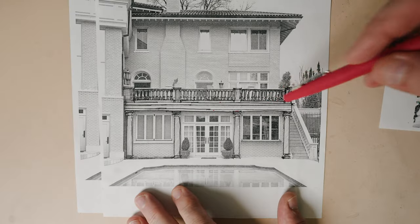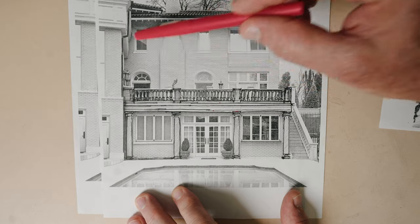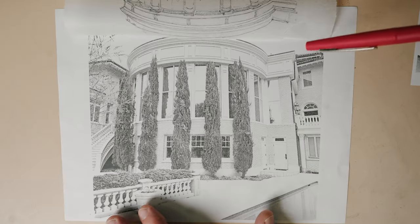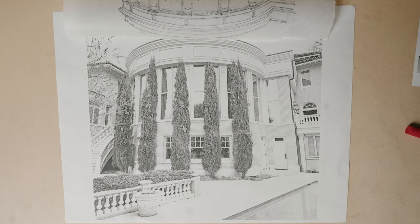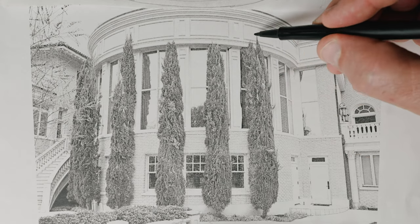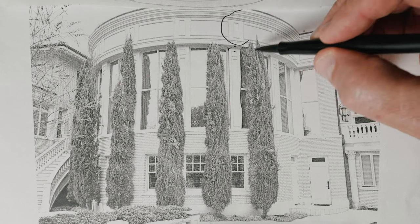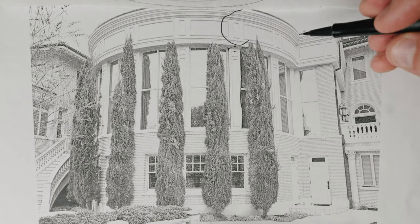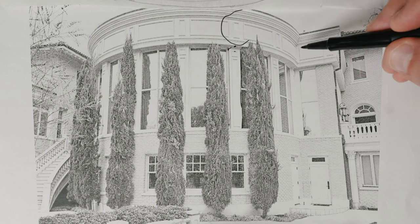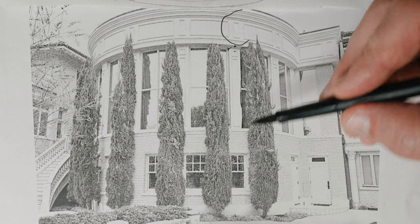There's a quick way of thinking about the balustrade, but more important is this detail up here — let me show you how we're going to fix it. This was added at a later date and was not original. This rotunda piece had no top on it, and so this top was added at some point by some builder or architect. The problem is this is obviously a column, but the way it engages this capital isn't right. The capital overhangs the column by about a foot, which appears cumbersome and large. Because they didn't understand the classical system, instead of putting an entablature up here, they just built this panelized system — whether that was easier or a cost-savings decision.